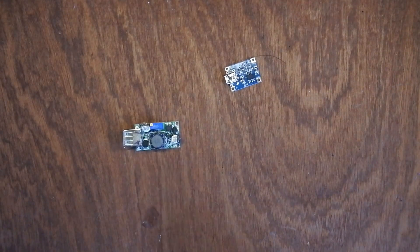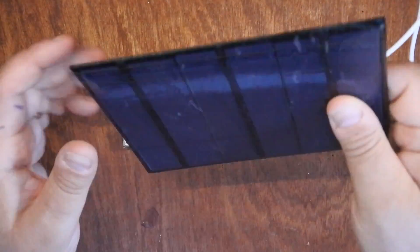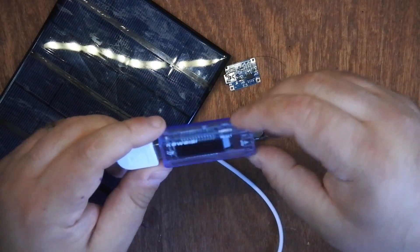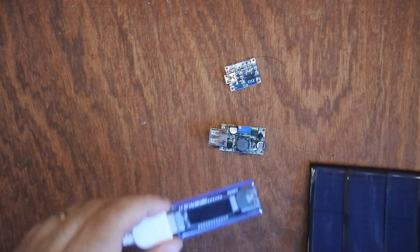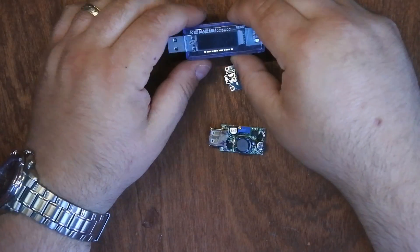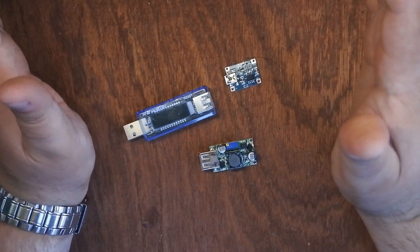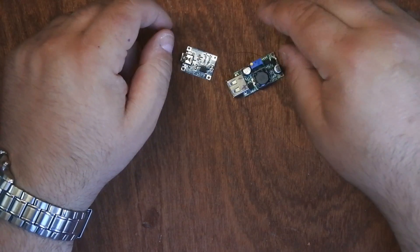One of the things I found on eBay was these solar panels. They seem decent enough, possibly a bit flimsy — I would worry about them falling apart — but if you built them into a secure housing they should be okay. There's not much light in the shed right now, but let's see if I'm generating anything at all. I'll just hold this to the door. They generate five volts and anything from like 50 or 60 milliamps in the shade up to about 400 or 500 milliamps, which isn't bad. You're probably going to be down at the lower end usually because of the climate we live in. But anyway, what I want to do is build at the very least the basic structure of a power bank.